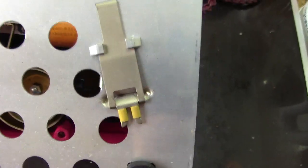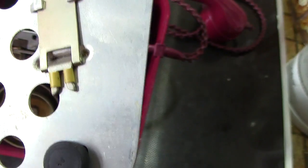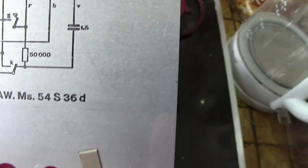Same idea with the ringer control, as the ringer in both cases are in different positions. Obviously the adjuster is in different places. Those two little lugs there hitch over the hammer of the bell and you reduce the sound. I'm just looking on there, to see if it shows you the actual bell coils. Yeah. There's the bell coils there.